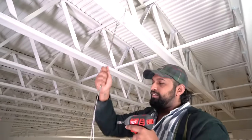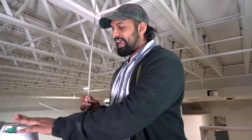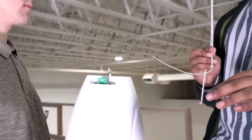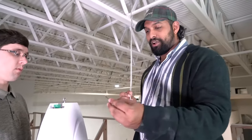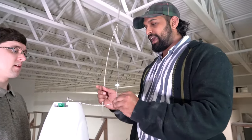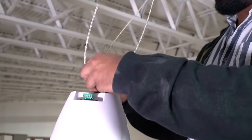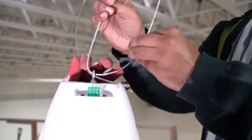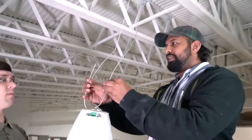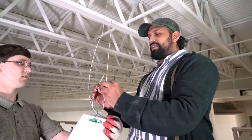Now I have a nice firm connection with the rest of the cable to hang my speaker on. You're going to take the other end of your stainless steel cable and run it through the eye loop on the back of the speaker. But before you do that, you want to take another wire clip and run it through first — put the wire clip on first, then run the cable through the eye loop of the speaker. Since I have additional slack, I'll run this cable through as well. With the end that we ran through the eye loop, we're going to pull it up for the appropriate amount of slack.